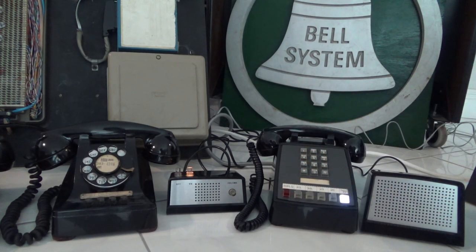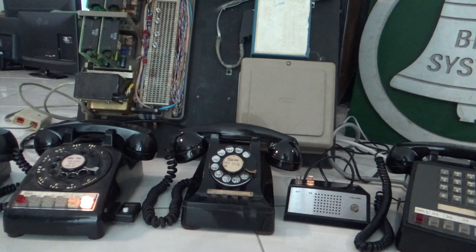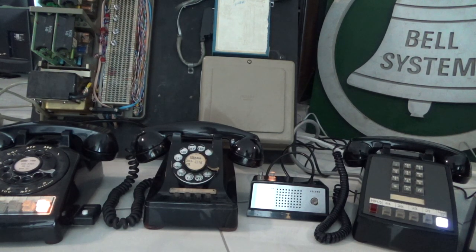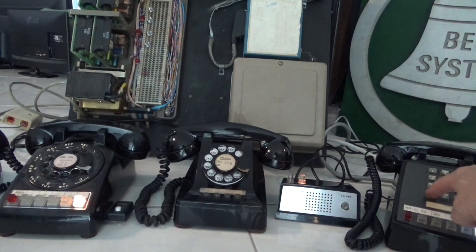Another feature on the Valcom unit: if I want to dial another extension on the intercom without losing the intercom path — since hanging up lets someone else grab the line — I press pound to get dial tone back from the Valcom unit. Then I dial one for that phone, buzz it, and hitting star buzzes it again without re-dialing. If no one answers and I want to try someone else, I press pound, get dial tone, dial a new extension, and continue.